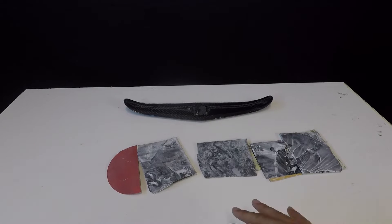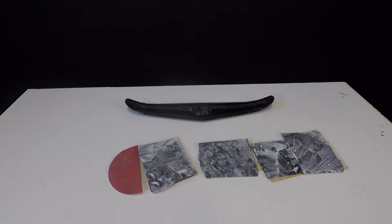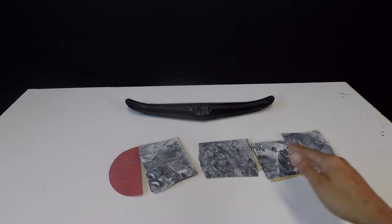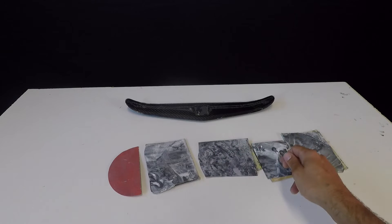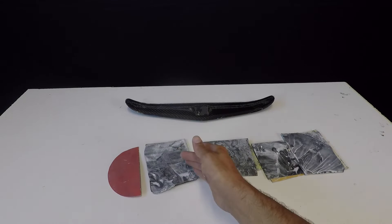Before we get into it, I'll briefly lay out what I'm going to be using — you can tell I've already been using this sandpaper before, but you can use it over and over again. I'm going to start with 150 dry — not wet sanding — that's going to take down just the really high spots and clean up the edges. Then I'll move to 220 and start wet sanding, then bump up to 320, 400, and finish with 800. For a mirror finish you can go up to 1000 or 2000 grit.